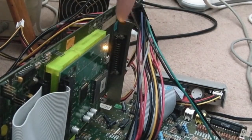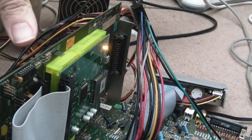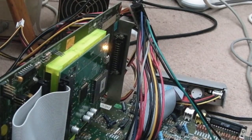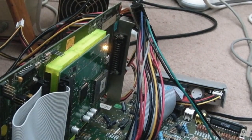Previously, before we did that wire, it was not detecting the A2091. The 8MB RAM board was kind of stealing all of the autoconfig stuff. It wasn't allowing autoconfig to operate normally. And you can do a similar thing with the A590. There's going to be a pin on the A590 that you can connect to this RAM board, and then you will have 8MB using an A590. But bear in mind with the A590, if you've got 2MB on board, you need to disable it probably.